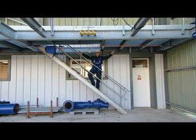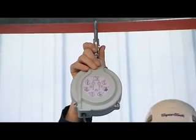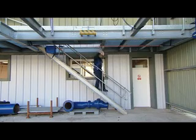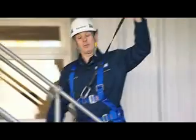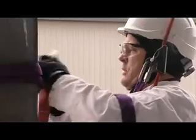This is a typical application of the horizontal safety line. We would span the 20-meter line along the side of a ship to protect a worker, providing full fall arrest anchorage over a 20-meter span while walking up and down over the sea. He simply attaches an inertia device to the horizontal safety line, connects into it, and he's protected. The operation involves moving a block along as he walks to the sea's edge. Should he fall, the device will engage and suspend him above the water where he can be rescued or self-recover.